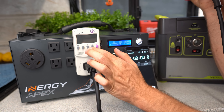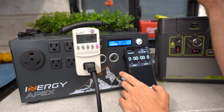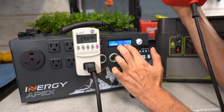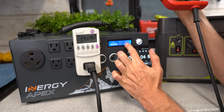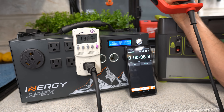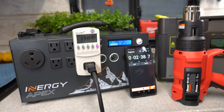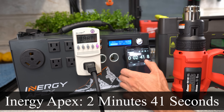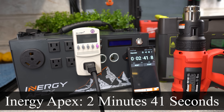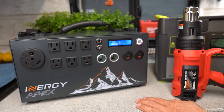First we're going to turn it on, we have a watt meter on the watt setting, and right when I press the heat gun starter we're going to press start and see how long we can power this for. We've got 1600 watts and 1300 watts at the outlet. We're going to see how long it can run. So 2 minutes and 41 seconds when the inverter cuts off, and we discharged 16% of the battery in that time.